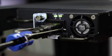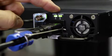If the AC power source has an on-off switch, set it to the off position. Plug the power cord into the AC power source. Again, if the AC power source has an on-off switch, set it to the on position. Verify that the AC OK LED on the power supply is steadily lit.